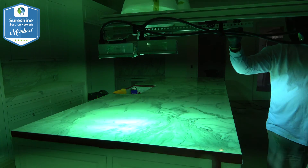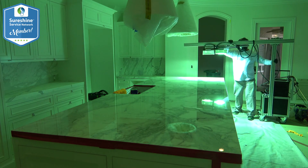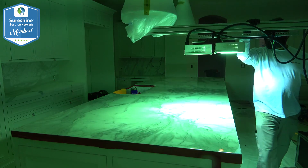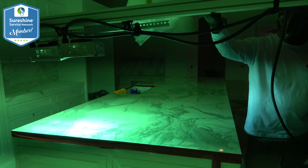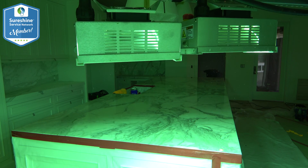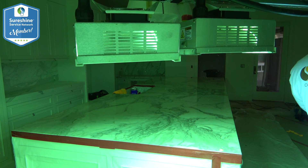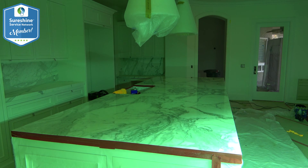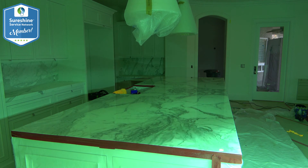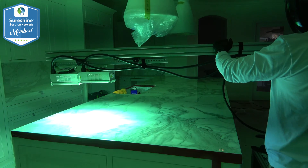This is best practice from the curing cart — the way I do it with the most success. Warm up your lights and lamps off-site, at least 10 feet away so you're not affecting the wet anti-etch or anything on the surface. Allow your lamps to warm up two to three minutes to get them as bright as possible. Once you swing over, go quickly. You're going to pin the cart at 24 inches high — the highest possible setting — then go down about halfway. That accounts for about five percent of the cure, and then I lower it to 12 and roll over the countertop for another minute or two.